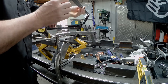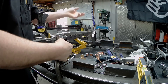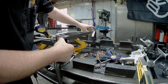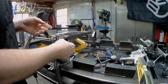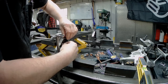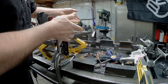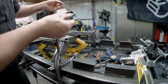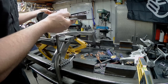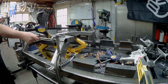It's hard to do the center-to-center measurement on this stuff and be somewhat sure. So if I just register up against those back arms, I've moved this side of the head to exactly one inch, push it up tight, and slide this other head over — that gives me a center-to-center measure by doing inside of one to outside of the other. That's actually more accurate than trying to measure and look at it because I'm getting a direct measurement. It reads right on the design at 19 and 11/32.